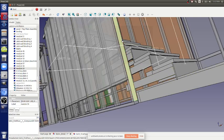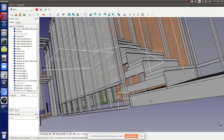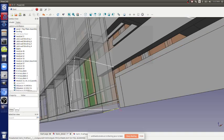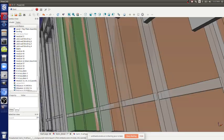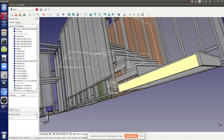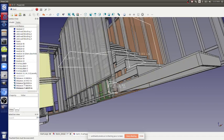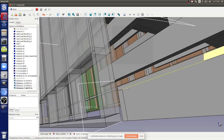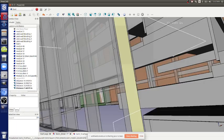So the critical parts are, what are all these heights, the rises? Mm-hmm. And that number there is 7, looks like 7 3/4. Let's get a better measurement. Eight. It's to there. Oh, well, that's exactly 7.5. Yeah, it's really good. So it's about 7.5. So you measure every 7.5, you keep going up.